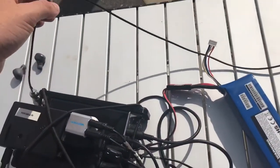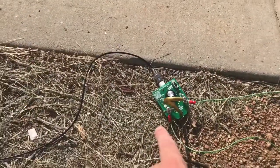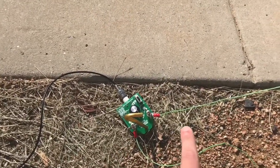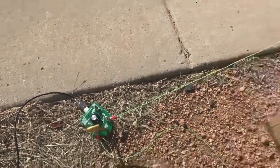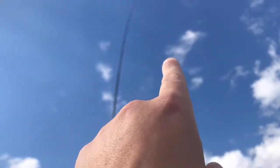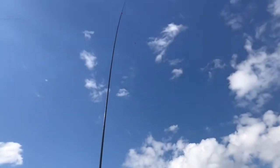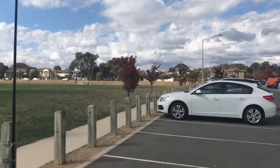What I've got is about two meters of RG174 going down into the QRP Guys NFED half-wave antenna kit. It's got a counterpoise and the active line. I'm operating it now as a sloper at the moment from my squid pole. It's actually a linked NFED — just about a meter off to that side there is the link for 20 meters.